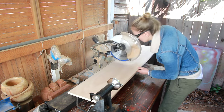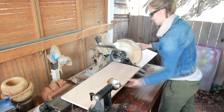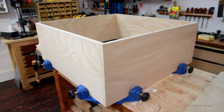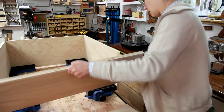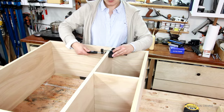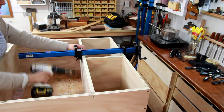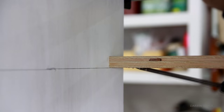And this is the kind of plywood I use for most of my projects. I started building the base, and these corner clamps really make it easy to get perfectly square corners. For the construction I'm simply using glue and screws, and I'm pretty much building a box. Putting in a middle shelf, then a separator, and using a clamp to keep it in place. Then painting the unit, and I'm also adding some additional support in the back with some pocket screws.